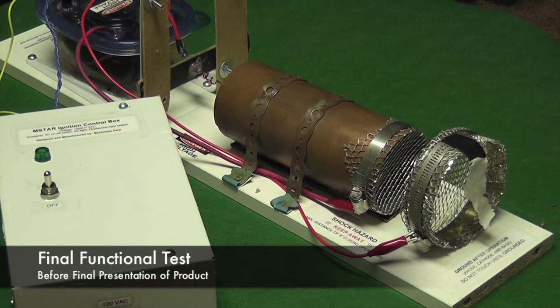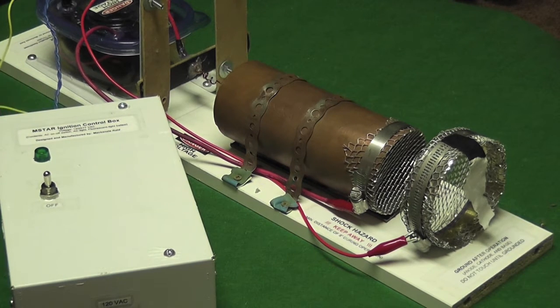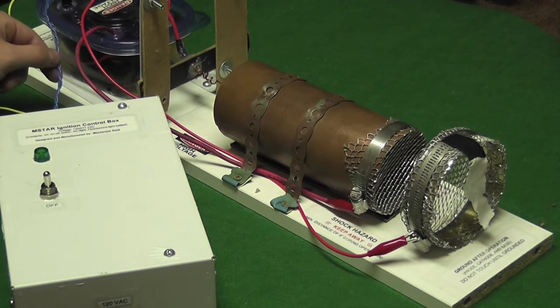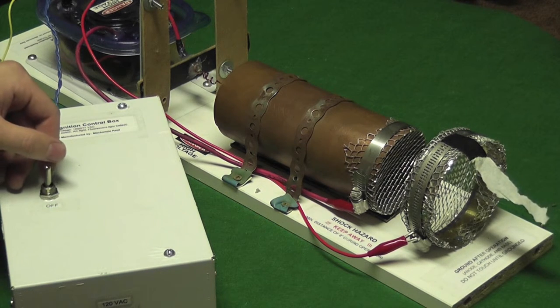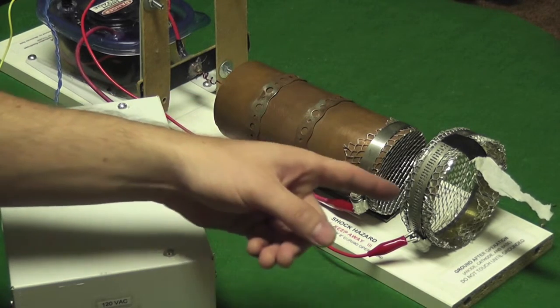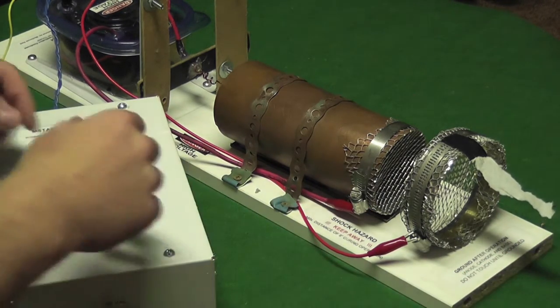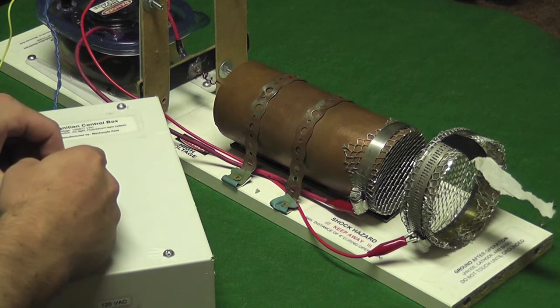This is what it looks like all together. As you can see I have the control box — we've got the yellow cable attaching to one of the input terminals for the flyback and then the two blues connecting to the other one. I'll just flick on the switch. As you can see, the anode is ionizing the air and it's being attracted through the cathode chamber, through the grid on the end, and then being neutralized by the other grid — producing not very much, but a little bit of thrust. Obviously at a small scale like this, the thrust produced wouldn't be that significant anyway.